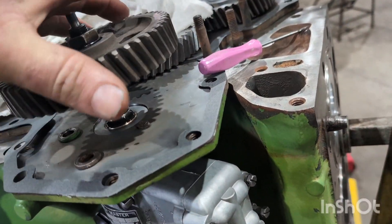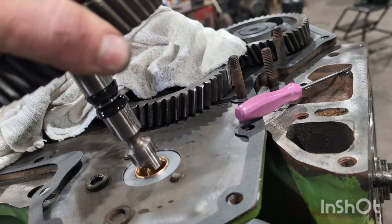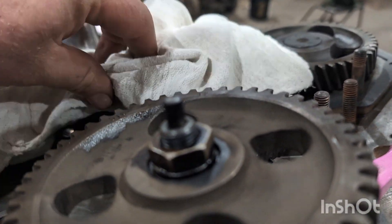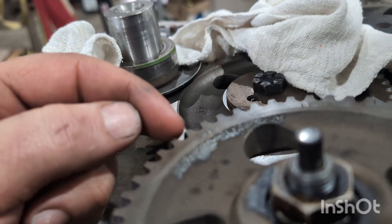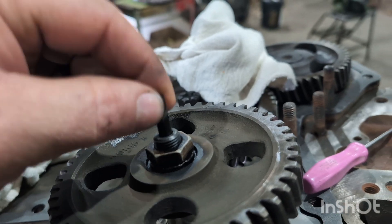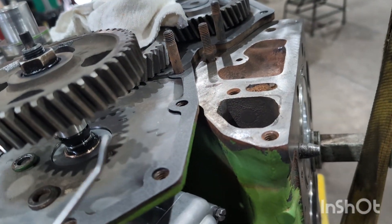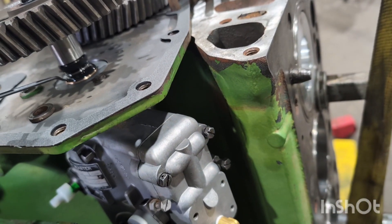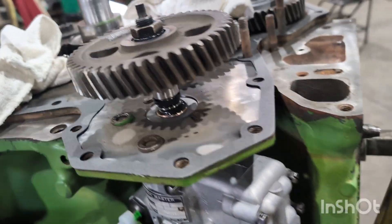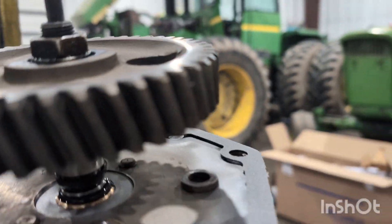The fun of this injection pump is the little cup seal — we've got to work it into place. It's not hard to do. We've got our three-six, we're going to aim it to the crankshaft. We've got our button in that goes against the timing cover, and you're going to take your kind of quote-unquote dull O-ring pick and just work around it, using your other hand to support the weight.